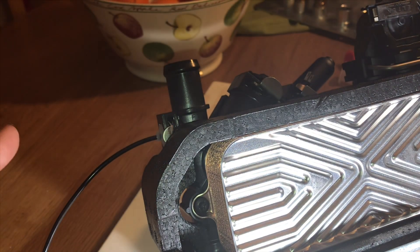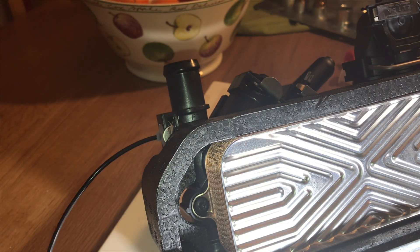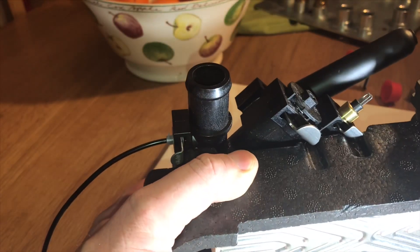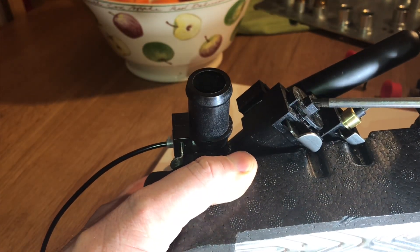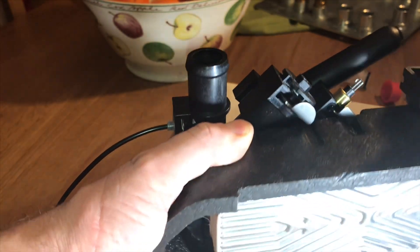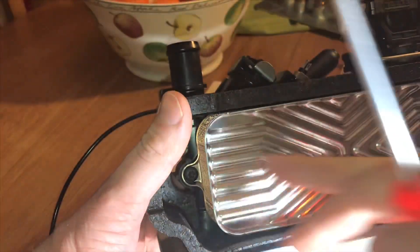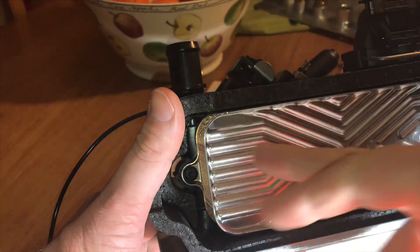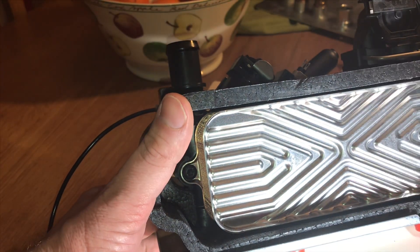This is the composite that's in the 050 and the 200 combi range. In the 050 there's no bypass. Let's talk about the plate-to-plate — so if your hot water is fluctuating hot and cold, it's more than likely the plate-to-plate on the 200 range.